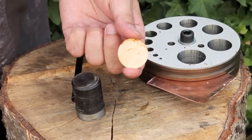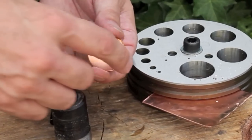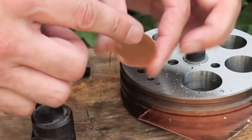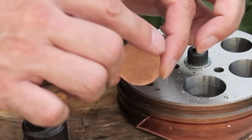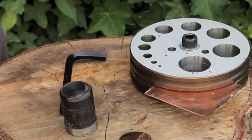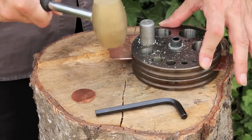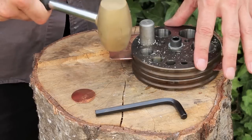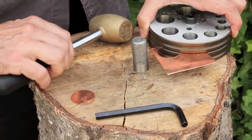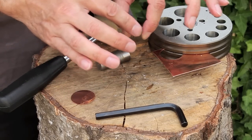So, nice solid surface, two-pound brass hammer, and here we go — four blows, not too hard. There you can see the finished disc. All this is just grease that's come out of the unit — don't worry about that, it'll clean up. The edges are nice and smooth and need very little finishing — just run around with some sandpaper or pop them into the tumbler. What you want is several good sharp heavy blows; you're not tickling it, you need to force it through.